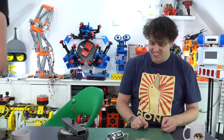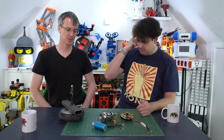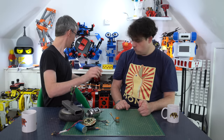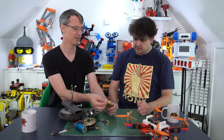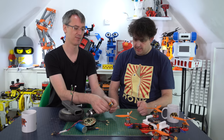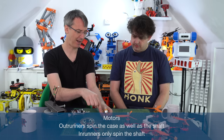One thing is Googling all this stuff, but another thing is to actually touch it and see it with a proper explanation. So these are all brushless motors. This little drone motor is three phase - it's got three wires to go to our brushless motor driver. No hall effect sensors in this one. This is an outrunner - you'll notice the casing turns. The coils inside are fixed and the magnets go around the outside, which gives it quite a lot of torque.